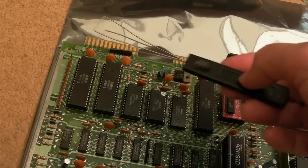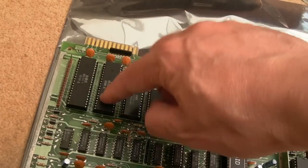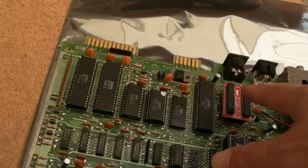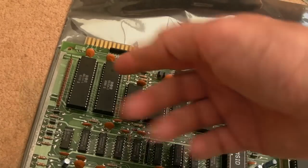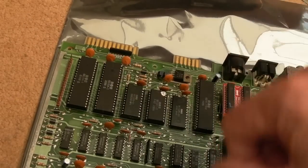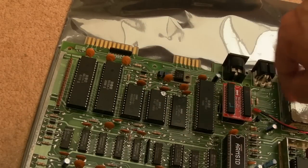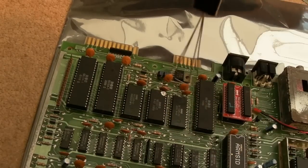I've even seen the same thing on a couple of Amiga boards, on the CIAs there, where some damage occurs to a pin on one of the ports that means it's not quite as good at pulling one way or the other as it should be. But as soon as you deal with the voltage issue, clean the power connectors and the power switch, and get right back up to 5 volts, the problem has gone away. I've got a couple of CIAs like that that I keep for testing, and they work perfectly in every board I throw them into. But if I put one of those CIAs into a board with a dirty power switch, for example, at 4.7 volts, that CIA will be a problem. I've seen it on joystick ports as well.